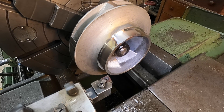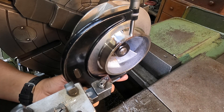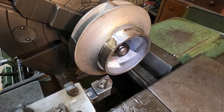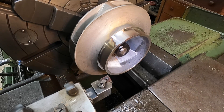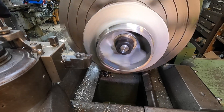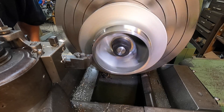Pretty close - that's going to be pretty good. I went ahead and just took 12 thousandths; that's probably going to leave it just a touch over. We're at 222 right there. So with our undercut now it'll definitely clean all this up and we'll have a nice round journal once we finish it. Go ahead and get this face cleaned up some too - just clean most of the weld area up.